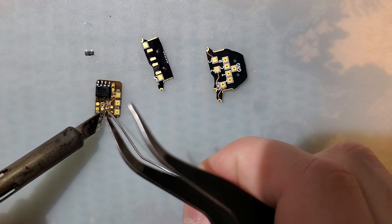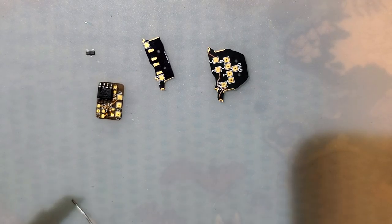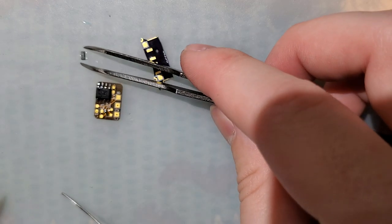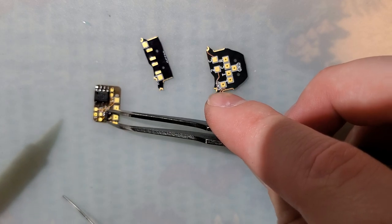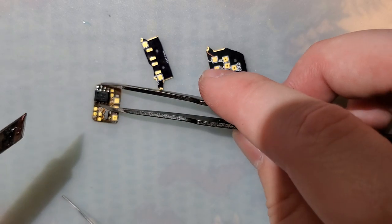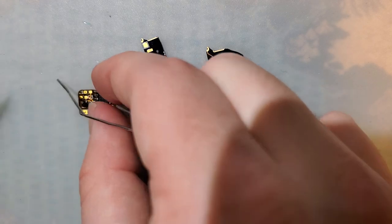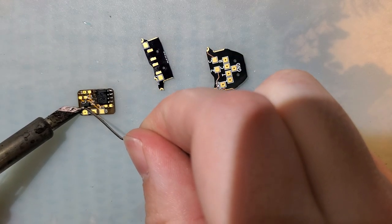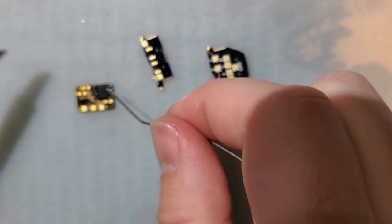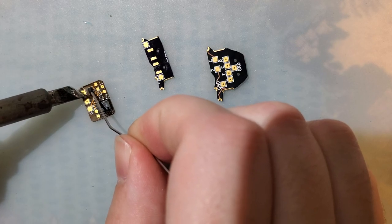That is kind of difficult to solder to with that via. There we go. It's much easier on an actual regular board. Maybe I should not put that via in the pad. I know that's normally bad practice, but for boards assembled by hand, it really doesn't make that big of a difference. I know if you're using solder paste and a stencil, it'll be problematic. But I'm using neither, so I'm not too concerned. All right.